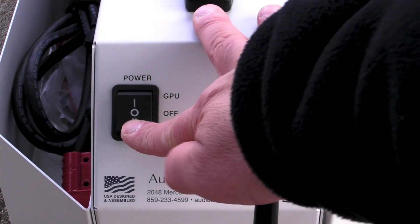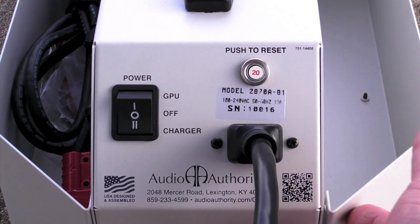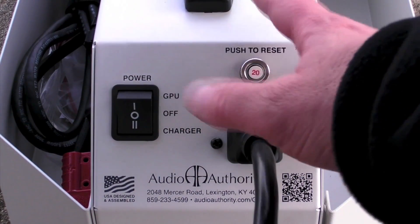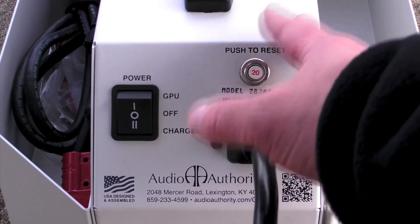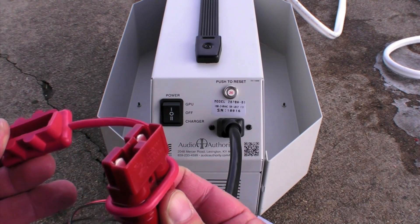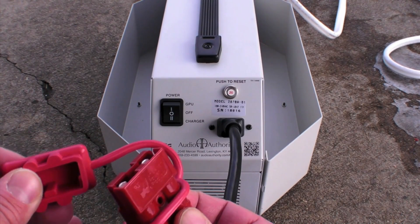The 2870A is more than a ground power unit. It also has an integral battery conditioner housing the Battery Minder — a product made by VDC Electronics. Like so-called battery tenders, the Battery Minder is designed to gently charge the battery as completely as possible and then continuously maintain it. It won't cook it like a traditional battery charger will. There's even an optional airframe interface kit with polarized mating plug for hardwiring the battery tender for an easy plug-in. It's FAA-approved and considered a minor alteration.